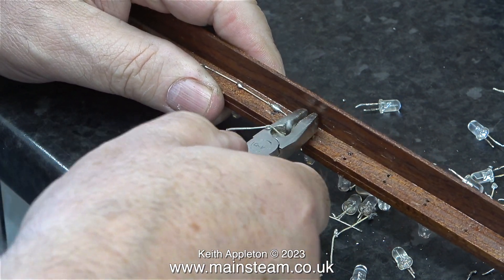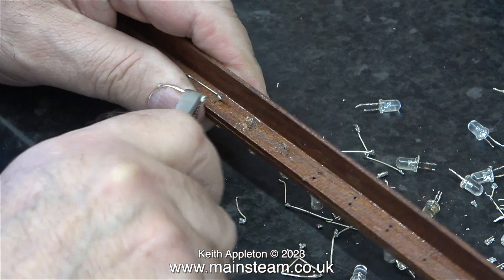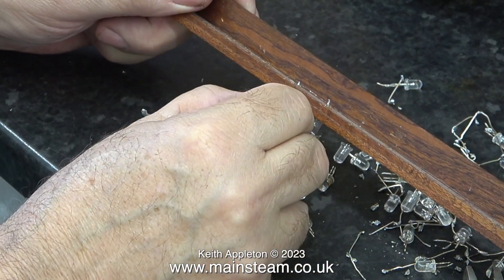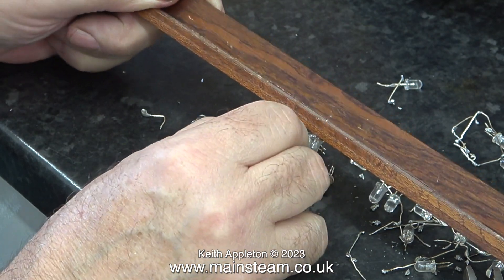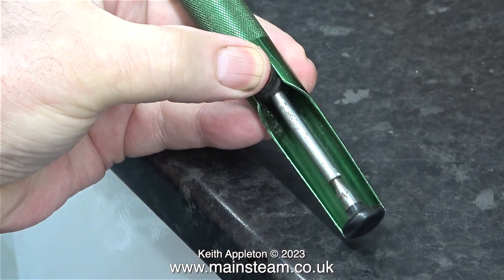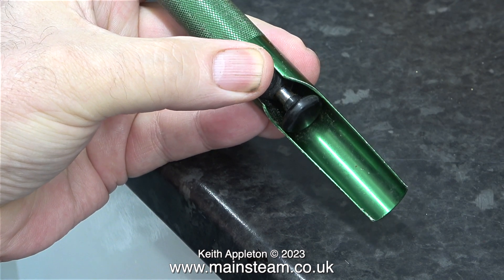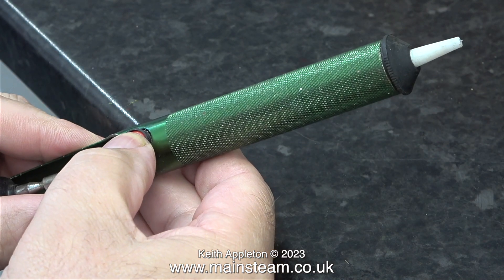On this rail the penny dropped. I used a pair of pliers and just unrolled all of the wire, breaking it away from the LEDs, and it took much less time than previously. Even removing the very last part it came away without any problems. All I have to do now is withdraw what's left of the LEDs — one was a bit stuck but the rest just fell out. I could have used a solder sucker — a spring-loaded device with a plunger that sucks all the solder off the joint — but it's nowhere near as quick for removing LEDs as the pliers method.